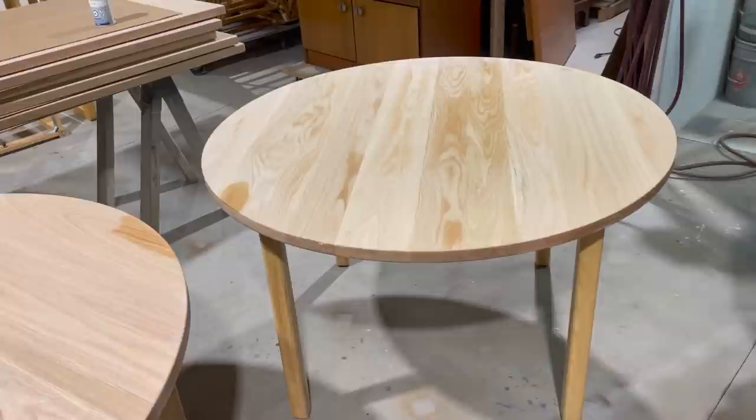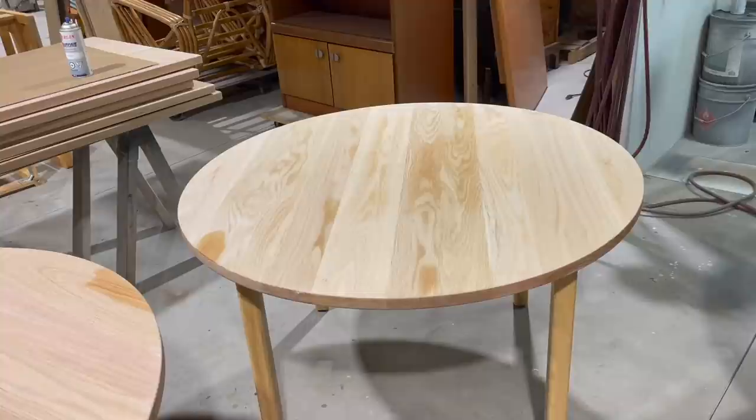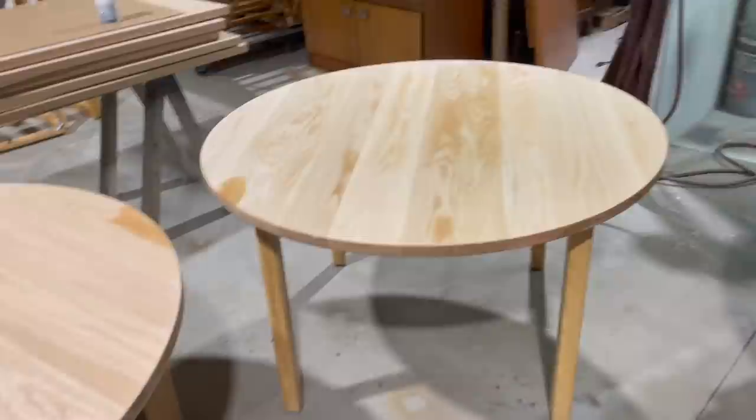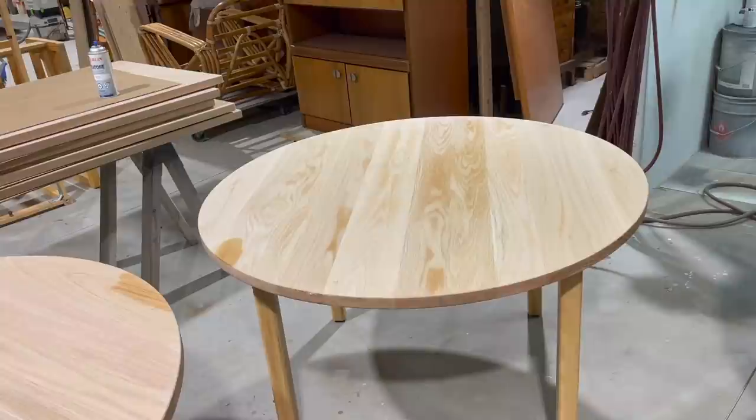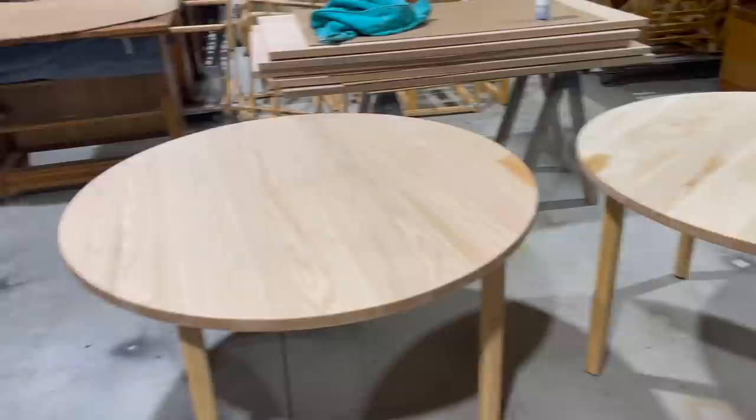And yeah, so it's not just a straightforward clear coat. I don't think I've ever done a straightforward clear coat these days. I always need a little bit of a tweak. So I'm gonna tweak down that yellow on the maple with my toning system, and then bleach the tops a couple times each, I think. And then neutralize that and clear coat and see where we're at. So lots of work to get them there, but I think that's gonna be the best situation.